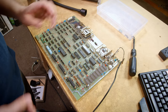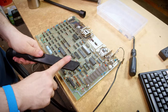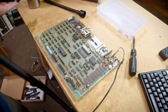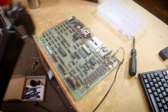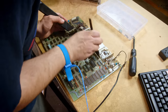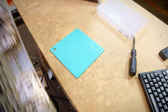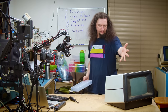Now I'm going to clean the PCB using my Atrix ESD-safe vacuum. It's grounded from the tip to the actual earth ground for the electrical system, and I've additionally grounded the board, so this is a safe way to dry-clean without getting anything wet - just pulling up the little bit of dust that settled on there. It really wasn't that bad. I'm going to call that clean on the main board and set it aside while capacitor reforming continues.